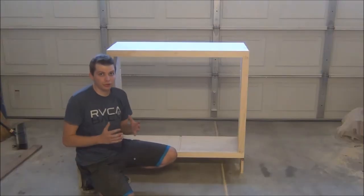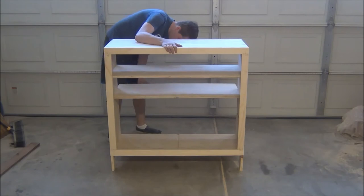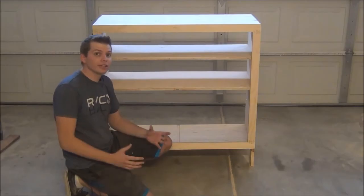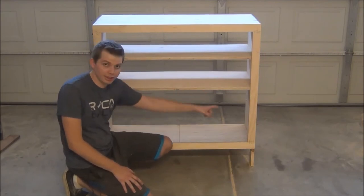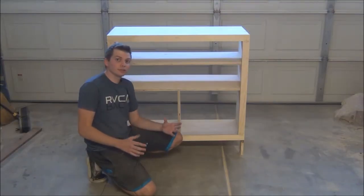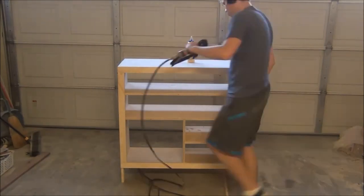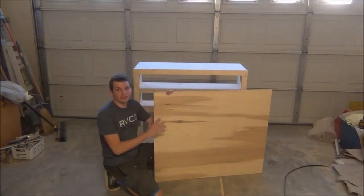Now we can begin to cut out the shelves. We'll start by cutting out the two top shelves, making sure to cut a channel on the bottom of the bottom shelf that matches the channel on the bottom of the cabinet. We can then cut out a vertical piece that slides into these channels, making sure to cut a channel into the middle of that that matches the channel on the side of the cabinet. After we cut down and slide in the last little half shelf, we can glue and nail all the shelves down so they don't move. Then cut down this quarter-inch thick sheet of plywood that's going to serve as the cabinet's back, and glue and nail that down as well.